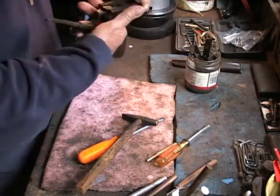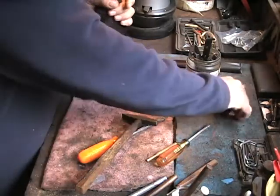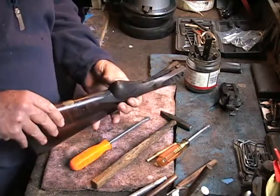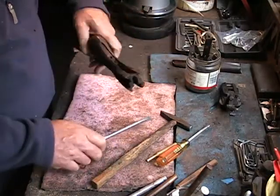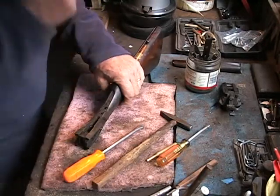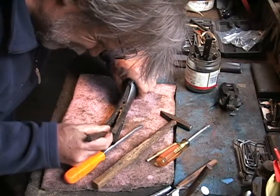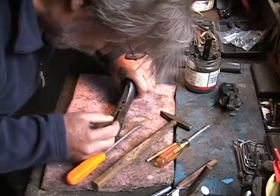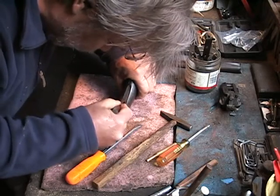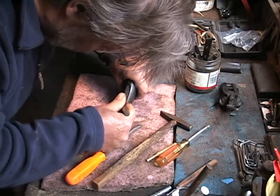There's the rest of the action — came right out. Having put a mold release on all these parts — they call it release agent — all of these kits come with release agent. We saved ourselves the headache of gluing the action to the stock. So again, just get rid of some excess epoxy. There isn't much here because we didn't bed the action; we just glued the crack and some of it squeezed out.